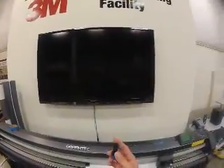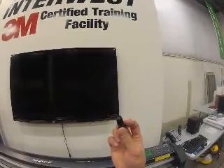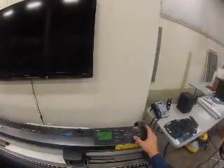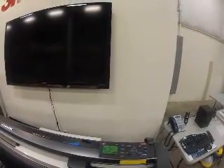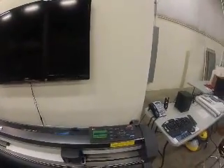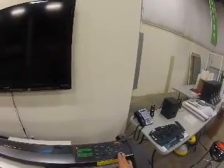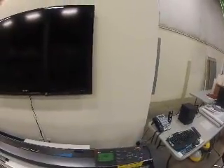This blade and blade holder is actually a different degree blade set shallower, and it's actually for window film. To change to window film, all I'm going to do is take my blade holder for paint protection film out, take my window film blade holder, and put that in place. Then I can go back to condition — condition one I have set for paint protection film, so I'm going to change that and go up to condition three, which I have set for window film. My window film settings: speed at 15, force at 9. I'll select condition three, hit enter, hit menu, and now I'm on condition three, ready, with my force and blade settings correct for window film.